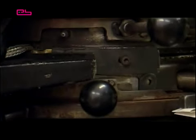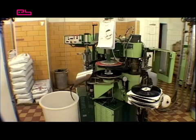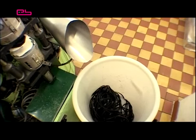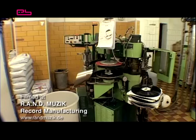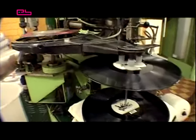The two labels per disc are added from the side in the same procedure and pressed onto the vinyl. After that, the press tools are flushed with water to cool the newly emerged vinyl disc. The pressing procedure with heating up and cooling down takes approximately 22 seconds per disc. Now the excess edges of the disc are cut off in order to reduce the disc to its final size, in this case a 12 inch. The cut off vinyl edges and the discs in general are recyclable and can be melted down and newly pressed several times. However, the quality gradually diminishes. The vinyl disc has a final weight of approximately 140 grams.